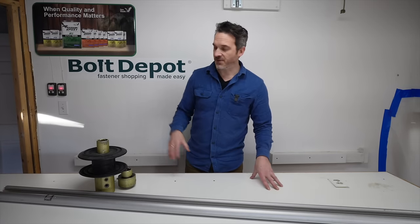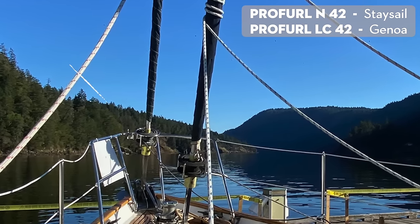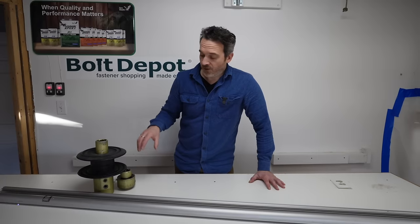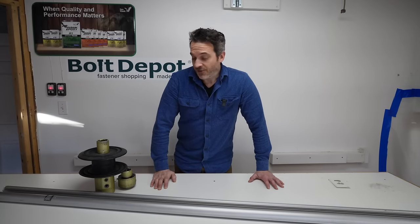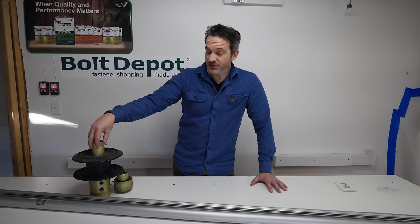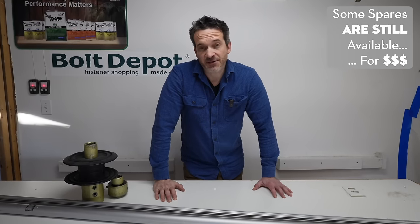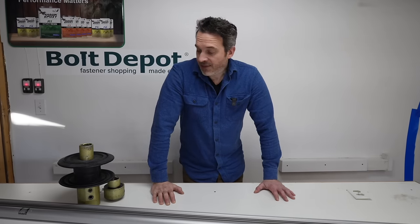Aboard Antidote we have two head sail furlers: what I believe to be an N42 for the stay sail, and then a Pro Furl LC42 on the head sail. These have technically been discontinued for 10 years, maybe even a little longer, but here's the thing — they're built with parts that are readily available still. Internal bearings, seals, and snap rings are all off-the-shelf parts. You can order them at any bearing shop, or Amazon, eBay, wherever you feel comfortable buying parts. So there's no reason we can't rebuild the rotating parts for these two furlers. Any aluminum extrusions or special castings for these Pro Furls are going to be very difficult to find, so if those are damaged you might be looking at replacement. But I think we can take a pretty good shot at restoring all the rotating components.